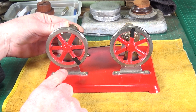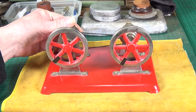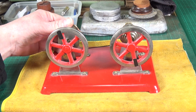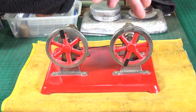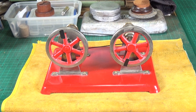That's under half a revolution on the big pulley and we've already done one complete revolution on the small pulley. So that's two revolutions on the small pulley and we still haven't done one complete revolution on the large pulley. You've got a gear ratio there of about two and a half — for one revolution of the large pulley you get two and a half revolutions of the small pulley. That is a good example of gearing up. Large pulley to small pulley gears up, so you get far more revolutions out of the shaft with the small pulley than you do out of the shaft with the large pulley.